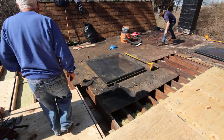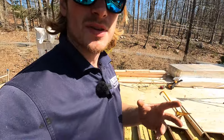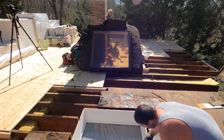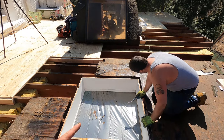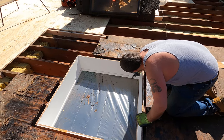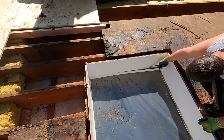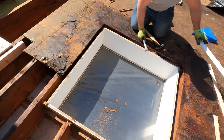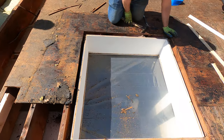Part of our job is to remove these skylights. We just pop the skylight out — it's sitting over there — and we don't bother removing the roofing because the skylight opening is going to get closed up. The first thing we did was take out the skylight, now we're getting all the trims off, and the one-by material that's nailed up here is going to get removed as well.